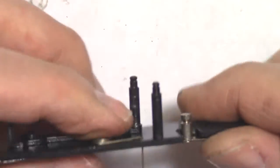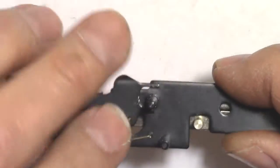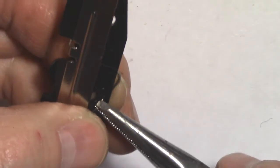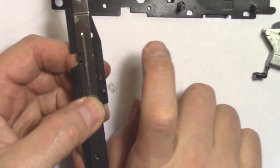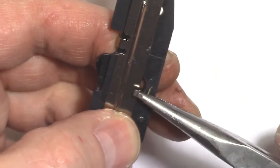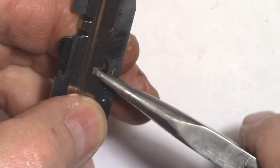Make sure the disconnector is flat. Use your thumb and push the disconnector end back towards the coil. Then take your pliers and bend it straight down, making a triangle — it'll make the coil more flush, but it needs to be tighter. Bend the triangle up towards the right; don't flatten it, just fold it over. Use your pliers and pull the point over, cinching it against the plate. Now the coil is flush.